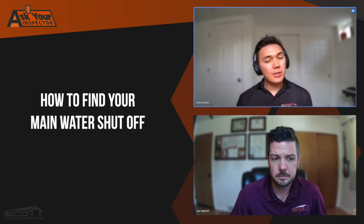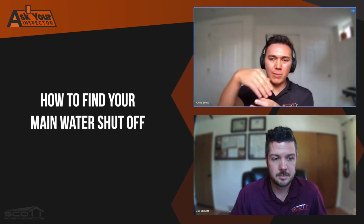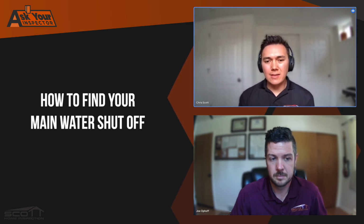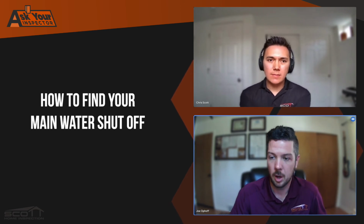Yeah. So another tip I have on trying to find your shutoff is very often, if you have a sprinkler system, your shutoff valve is fairly close to your sprinkler shutoff. And your sprinkler shutoff, when it exits the house, usually runs right into what's called a backflow preventer. That's that little loop on the outside of your home where it looks like a little upside down bell, and it prevents water from coming back into the house for your sprinkler system. If you can see that on the outside of your house, there's a fairly good chance that if you go on the other side of the wall in the basement or the crawl space, your shutoff is going to be pretty close to that as well. Yeah, there would be a shutoff for the sprinkler system, and then very close to that, the main shutoff for all the water supply to the property.